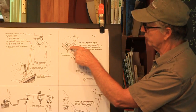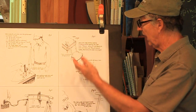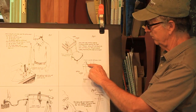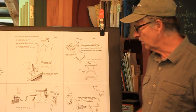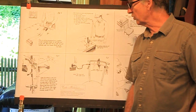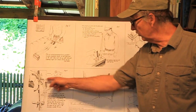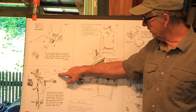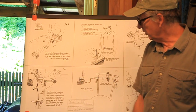The post should be lightly touching the front edge of the bench — you don't want to push hard against it or it'll probably change your angle. You'll measure the splay angle down here with the two bevel squares parallel with the front edge of the bench, and up here it's perpendicular. Then we'll go over to figure four and set up to drill for the crest rail. There's a close-up of the knob showing the seven-eighths shoulder that I'm going to bore and then come back with the three-eighths tenon.